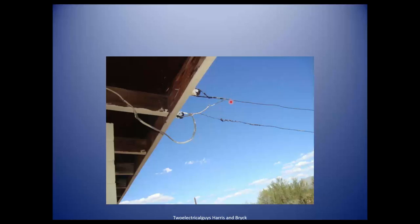There's no connector here. This should have been triplex wire — this is the wrong type of connection, the wrong type of wire. It's too small and doesn't have any place for stress. You can't use that type of wire overhead — triplex is the approved type. For those of you that moved from back east, a connection like this goes from every house to every garage east of the Mississippi — two bare wires to turn on the lights. If you touch it, you get shocked. Write it up and move on.